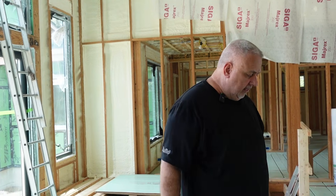Why didn't we just put up poly or something else in that ceiling assembly? We could have certainly put poly up, but we've been putting it up as a bad decision in our climate zone here. The smart vapor retarder, while it allows the moisture to migrate through, should we get too much moisture on the outside, it would basically let it back out and let it dry to the inside if we need that.